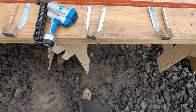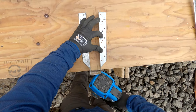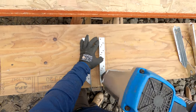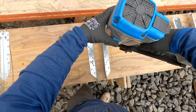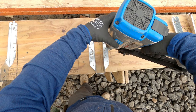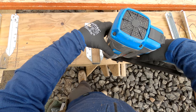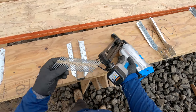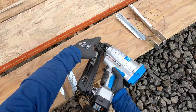Why did I write LVL on this? In filmmaking, that's what we would call foreshadowing. Why did I put the hanger there? Well, you'll find out. Look at all those nails — I would not want to have to be the guy that had to pull all those nails. Pulling all those two and a half inch nails would be miserable. Never nail a hanger in the wrong place. Trust me, you don't want to do it.